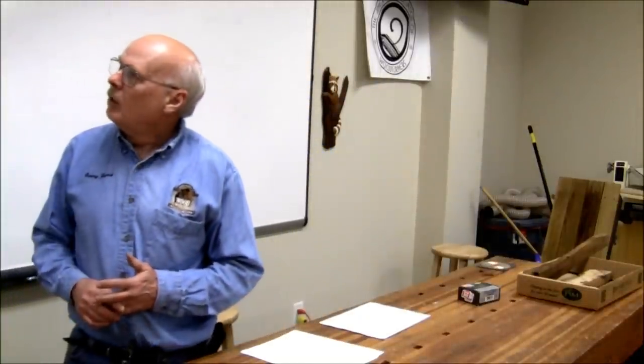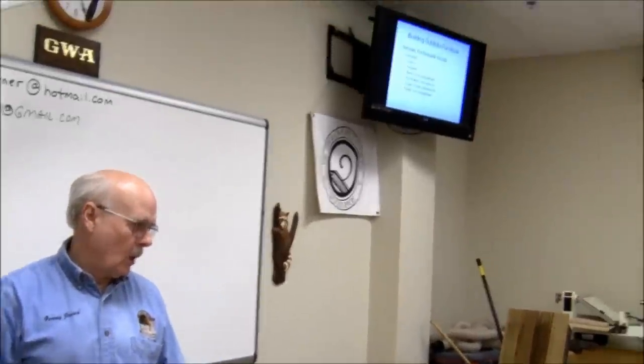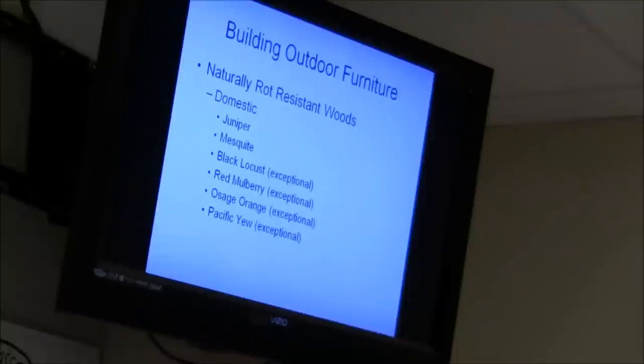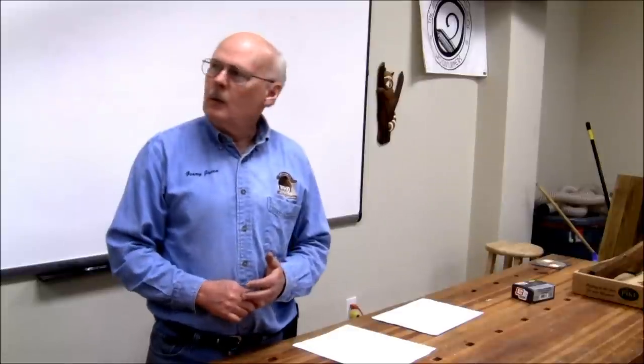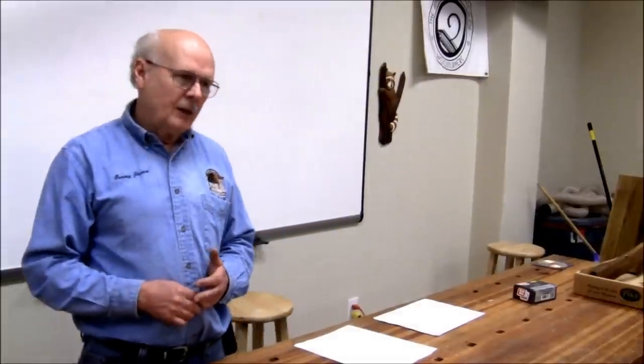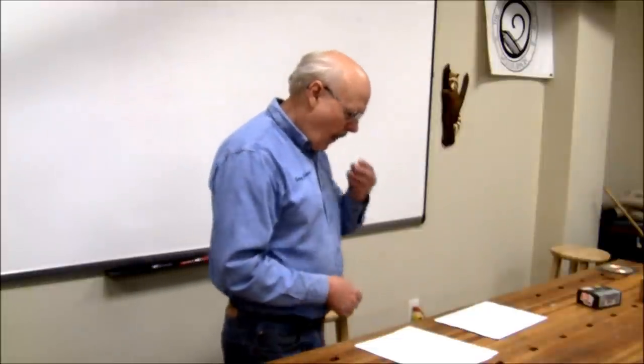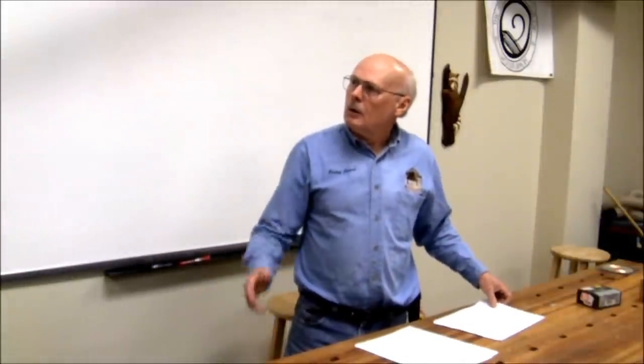There are some other less common choices: juniper, mesquite, black locust — which is exceptional. Black locust grows up north and farmers have used raw logs as fence posts in the ground for hundreds of years. Red mulberry, Osage orange — you see it down here but normally in small pieces. It's such a gnarly tree it's hard to get a long straight piece; mainly used for turning. Pacific yew I've never even seen, and those are also either unavailable or cost more.